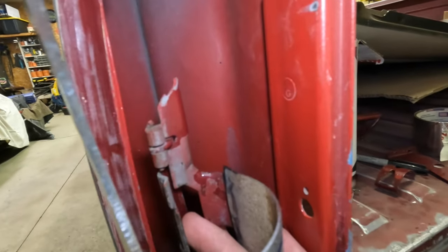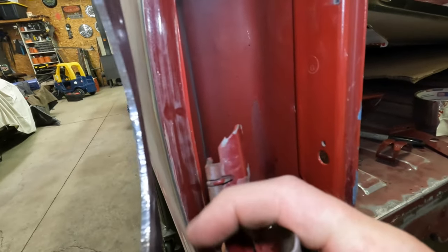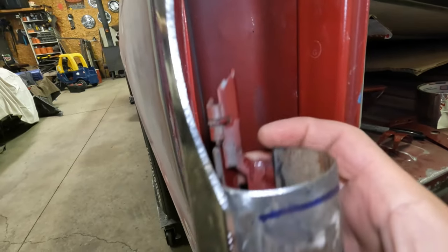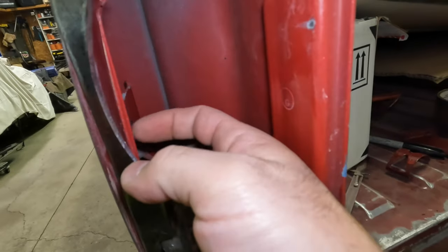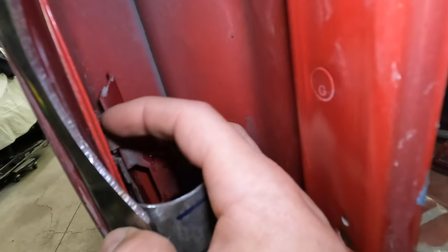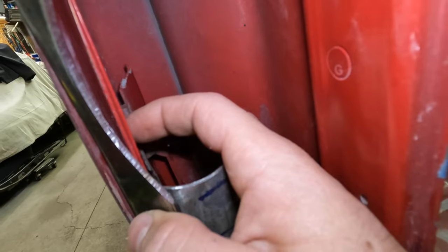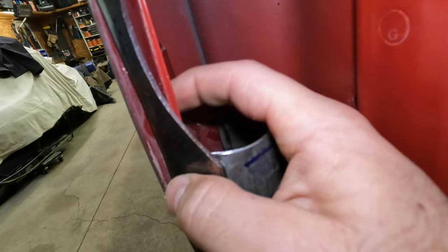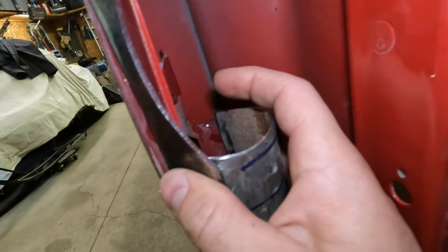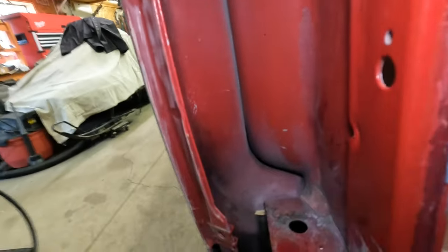I'm working on up-gauging this strap here. And as far as attaching in the vehicle, I have some room back here. So what I'm going to do is cut out a strip of metal and weld it on to this, pop a couple holes in it, so that I'll have kind of a bolt here in the same area on the bottom. And I will line those up and probably have either a drill pad I'll tack in here, or even tack in some studs. Because two quarter inch bolts with a decent size head shouldn't put too much stress on this sheet metal. By the time you put the welds on there, you'll have that kind of a footprint, just like having a weld stud in.